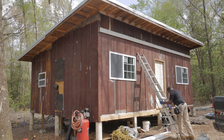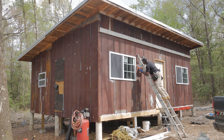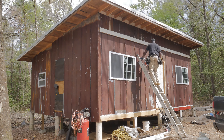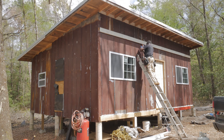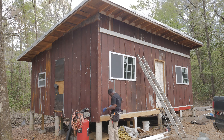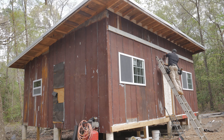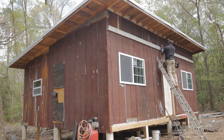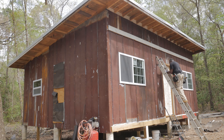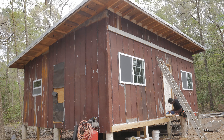I'm doing the windows and the 2x6 for the roof of the porch. Once I get this clear caulking on, water won't be able to penetrate it. Water is my enemy out here — that's why I'm closing and sealing everything as much as possible to keep all the water out, because water definitely rots wood over time.